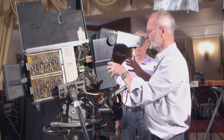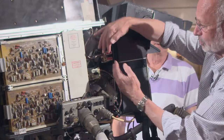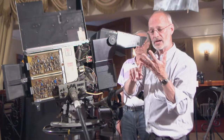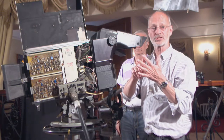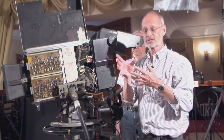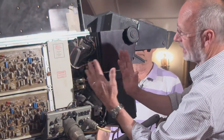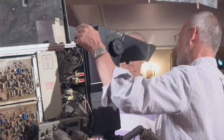So although it's big, its front-to-back length compared with other cameras like the Philips - which had the lens bolted onto the front of the camera - they took the view with this one to put all the tubes at the back. There were four tubes in this camera: three colours - red, green, blue - and a luminance signal which gave you the black and white signal. They crushed it all at the back here and put all the technical boards.